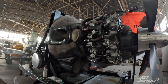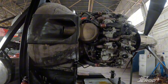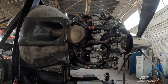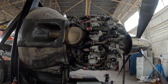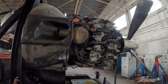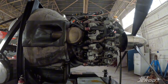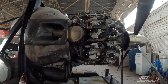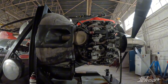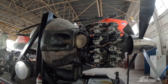In the late 40s and early 50s they were pretty much perfecting these radial engines. By then they knew what they needed to do to have more power — make them bigger, higher displacement. There's no replacement for displacement. But you get to a point where it's burning so much fuel that you have a lot of power but you can't go very far. So how do we recover some of that power? How do we make more power for the same fuel burn? That's where these came in — they're called PRTs: Power Recovery Turbines.